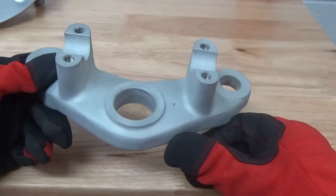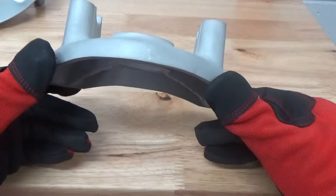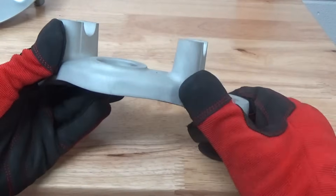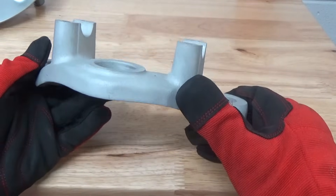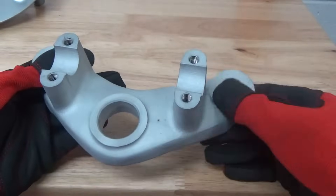This part has been blasted extremely well. It's a very consistent finish for a dry blast, but as you can tell, this is going to stain up pretty quickly because it's porous, very rough. It's going to grab any contaminant and actually absorb that into the metal.